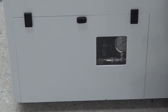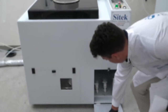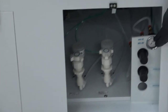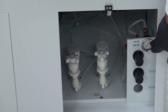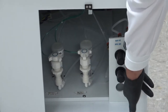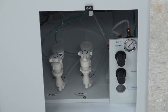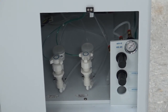All of that is listed in the manual. On this side we have settings for the surfactant dispense, the DI water dispense, the N2 for the nitrogen dry, and a gauge. There is also a wafer release setting at the very bottom, but that is not used in this circumstance as no vacuum is required for mask cleaning. The vacuum would be required if this system were configured to high pressure wash wafers as well.